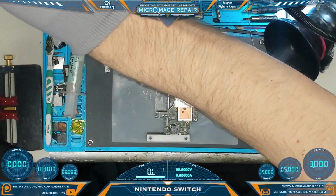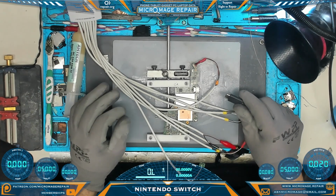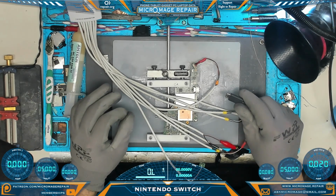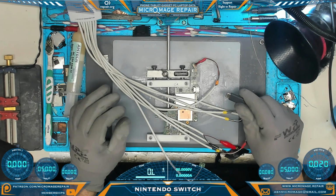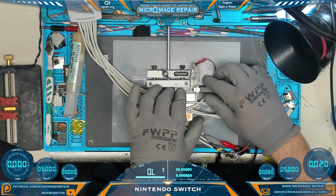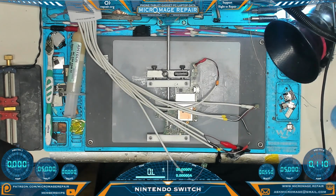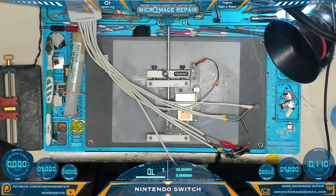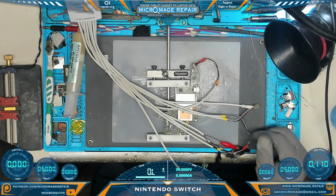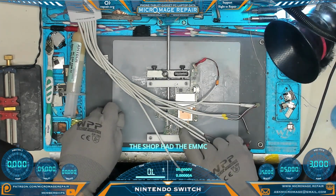Hanging is not really great, but the next test we're going to perform is with our modified iPhone Power Squid, which we have retrofitted with Nintendo Switch and Nintendo Switch Lite battery connectors. And we're going to activate using the OEM charger with a quick plug in and plug out. What we want to see here is just a steady current draw without hanging, which we are not seeing. Yeah, that's not what I want to see here. Okay, that explains why we're hanging.